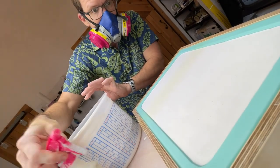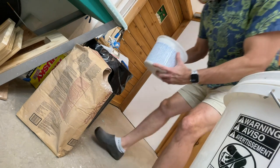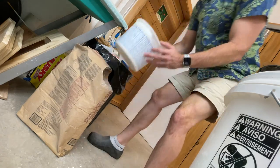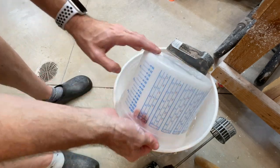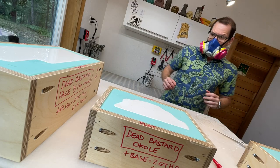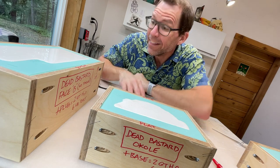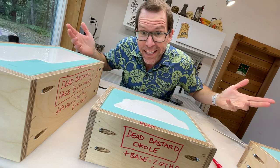We do a quick alcohol spritz. This leftover plaster will go straight to the bag it came in originally — those bags are watertight and they're great for dumping any unneeded plaster in. Do not dump this down your sink, and clean the buckets in that bucket of water. Do not clean these in your sink. The plaster is poured and the molds are setting. In about an hour, we'll be able to open these up and go through it all again.